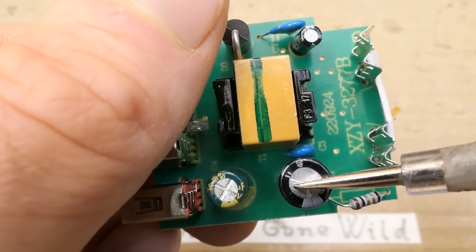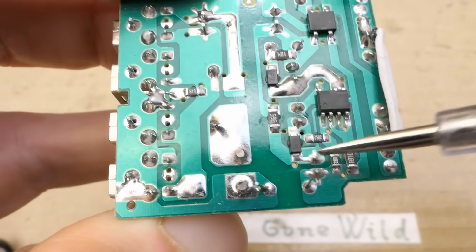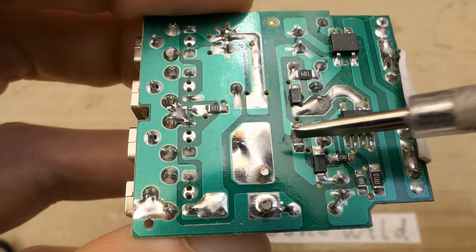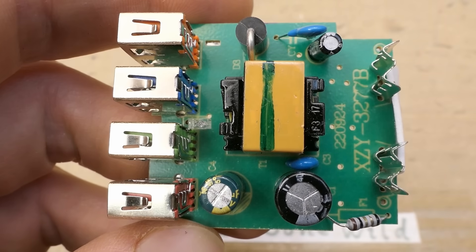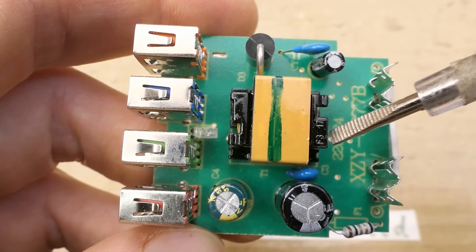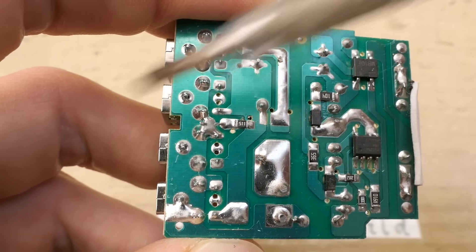The main primary smoothing capacitor, and the auxiliary capacitor for the low voltage supply for the chip on the primary side, rectified using a diode from the auxiliary winding. A couple more resistors in the voltage divider, sensing the voltage — because there is no optocoupler. It actually senses the voltage on the primary side. And having no optocoupler, there is no way the secondary side could tell the primary side to increase the duty cycle and increase the voltage.